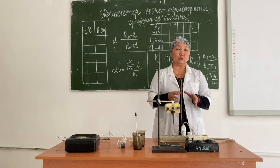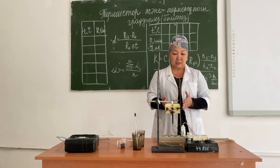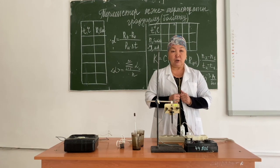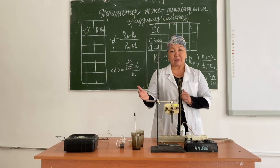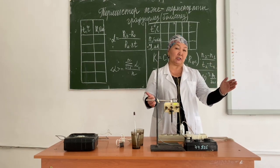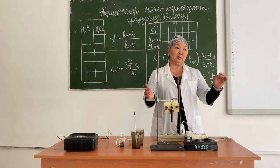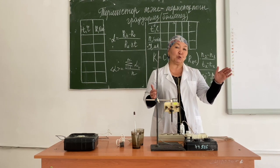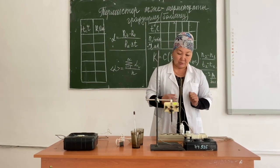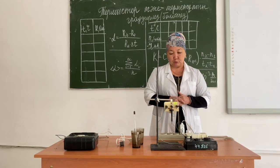However, the thermistor is way faster at this. The third advantage of a thermistor is its temperature range. It measures the temperature from 60 degrees Celsius below zero to 300 degrees Celsius above zero, and with a special order reaches up to 600 degrees Celsius above zero. But before using these devices, it is necessary to calibrate them.